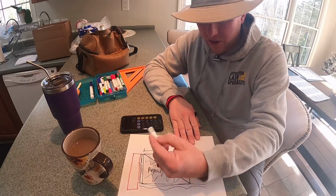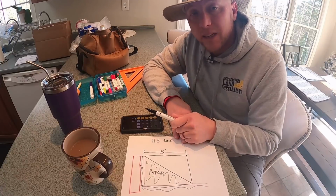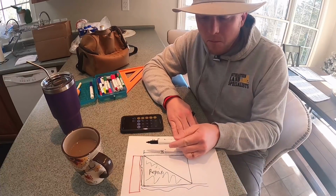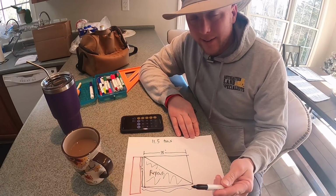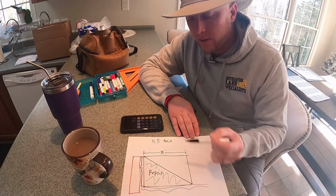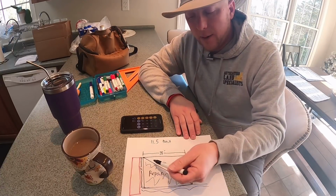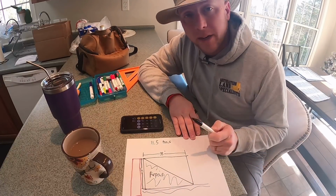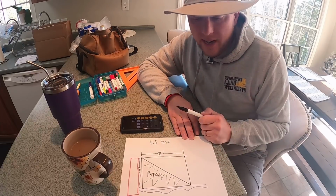It's not always going to be a straight bank because we just cut our estimate in half by tapering this down. And even if it was a straight bank, more than likely the erosion is going to start at a point and it's going to taper off because the pressure of that water usually gets reduced. So you can taper that line, and by cutting this number in half, you may be cutting the price in half from what a competitor would quote this at.